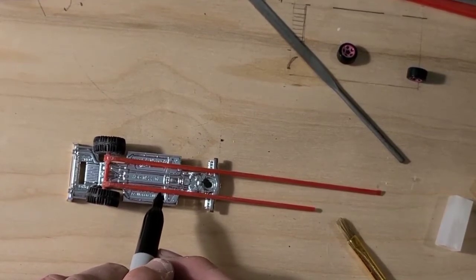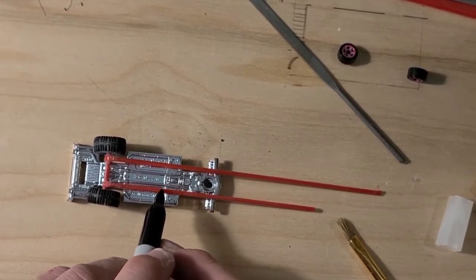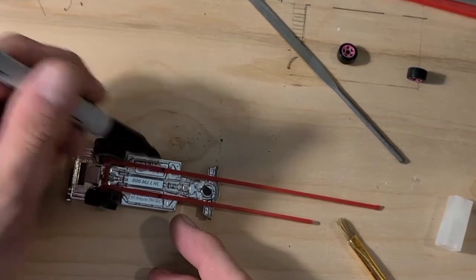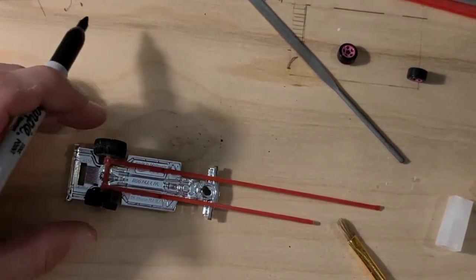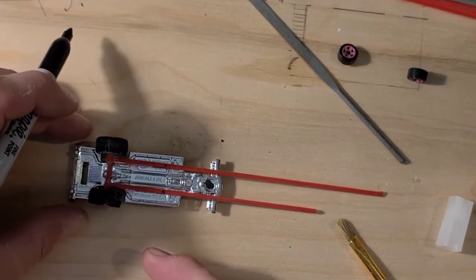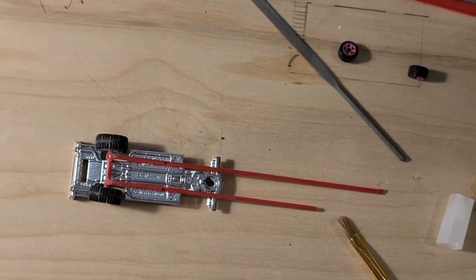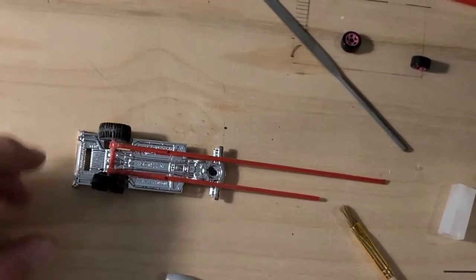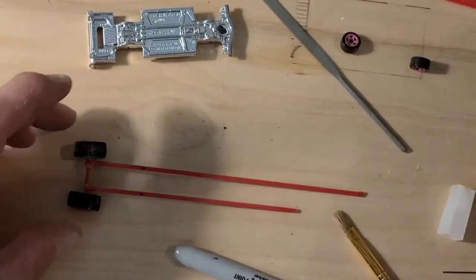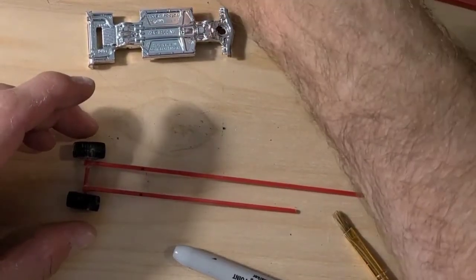We want to make it a little bit more than we need, and then we'll just trim it off. So I'm going to go 1/3 past the middle is my estimation, and trim these off and then see how it places. I'm almost 100% sure that's too much, but that's fine. I'd rather have too much than not enough. So our first cut will have it a little bit too big probably. So I got it marked. We'll go ahead and trim these off with our razor knife.